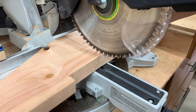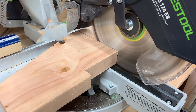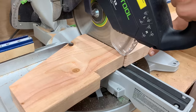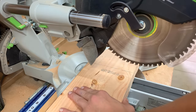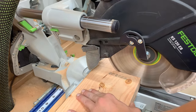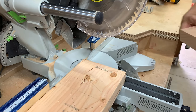Now I'm doing something a little weird. The feet on each side consist of three boards put together, and the very middle board I'm going to cut a section out of — I want the leg to slide down into this big three-piece foot. I basically traced out the width of a 2x12 on the middle of one of the three pieces that make up the foot. I'm really creating a giant mortise and tenon joint, and by pulling out this middle piece, that's the mortise I'm actually making.